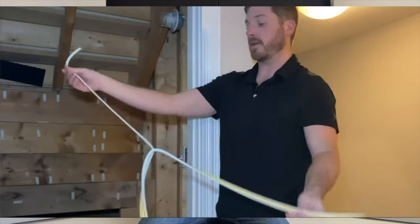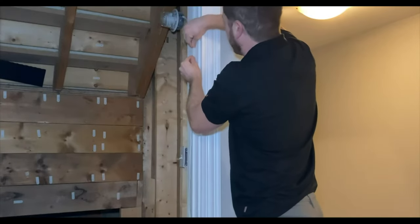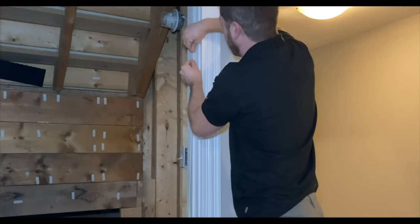If your door is still wobbly after you close it, the next thing to do is add a thin weatherstrip — not a big weatherstrip like the types you'd put in cars, because your door will just not close tightly. The one I recommend is a thin weatherstrip that separates, and it works pretty well. It's self-adhesive, so just make sure the surface is clean and dry before applying, otherwise it'll fall off. Add the weatherstrip on that small casing, and if the door doesn't close properly you can adjust the casing.